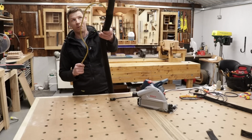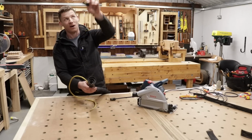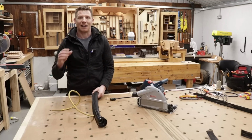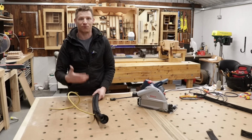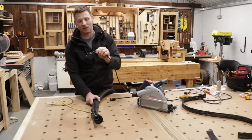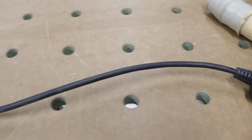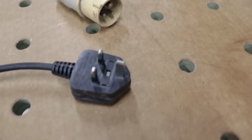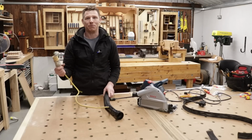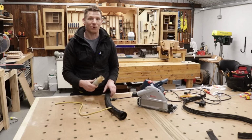I'm going to be connecting this up above my head to my existing dust extraction system. So I'm going to be using another one of these Knights Bridges plugs on the end of a cord up here. You, however, may want to use this with an actual vacuum on the floor that has a plug built into it, or a socket built into it for the use of your tool, in which case you would be fitting one of these 13 amp plugs if you're in the UK and Ireland, the 220 volt type, or if you guys are working out on site and you have to operate at 110, it would be one of these guys, you know the ones, the 110 yellow plugs, that would be going on this end, so you may want to leave this one be a little bit longer, and that can go into your vacuum if your vacuum works on 110. So that's what you guys will need to do if you're not using it in the workshop.